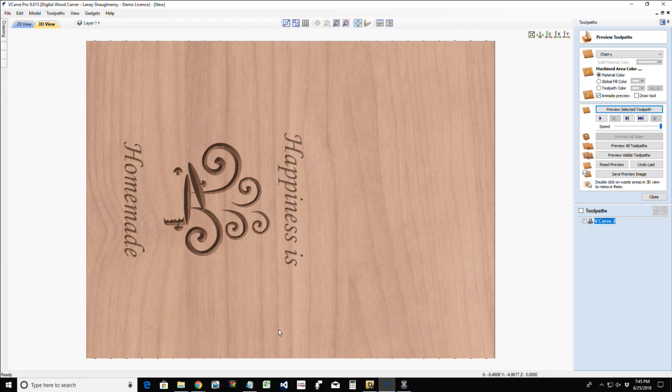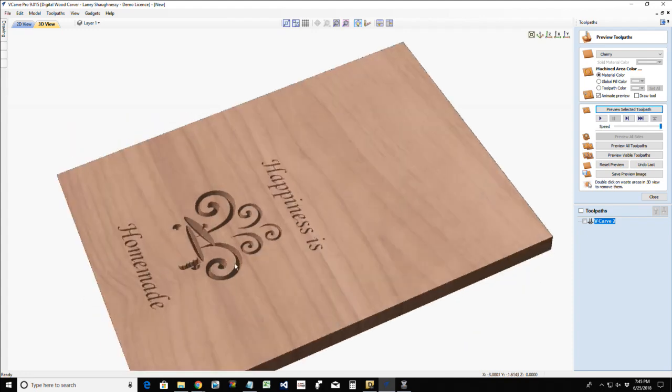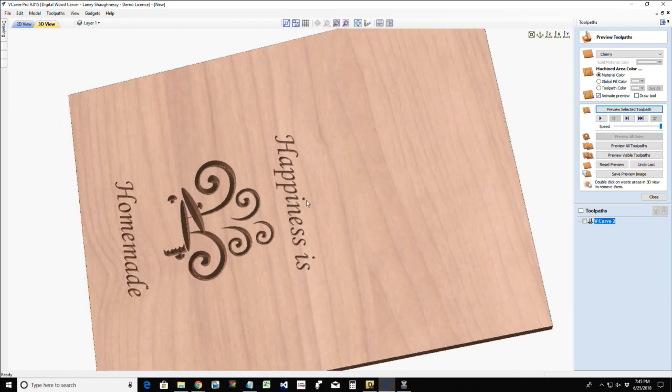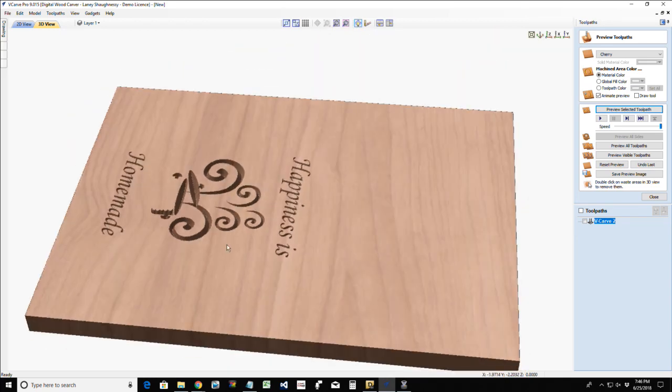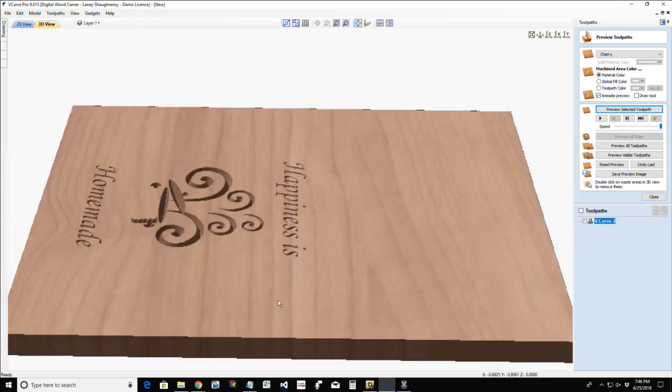We would definitely want to do some type of fill on that, because of course we don't want bits of cheese or veggies or whatever is going to be cut on this getting down in there. We could limit the flat depth and make it a very shallow cut, so that it has a flat bottom. We could do that, but still we want to have some kind of smooth surface, so we're going to have to do some type of fill. ECOpoxy, or, there's a lot of different food safe, very important, epoxies and resins.